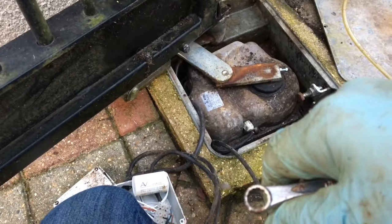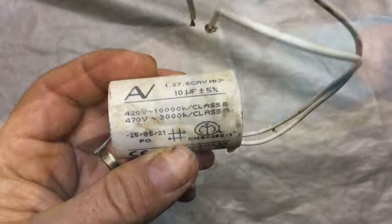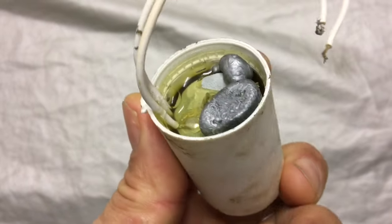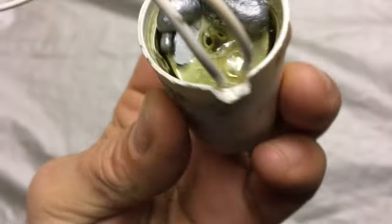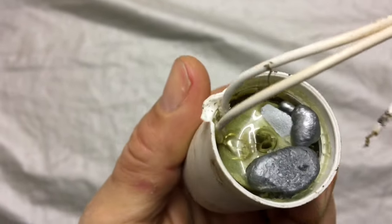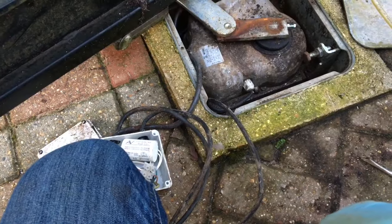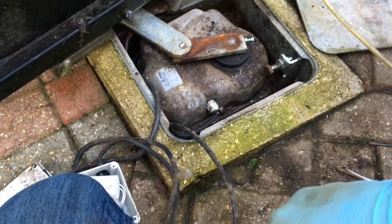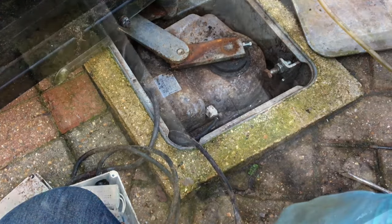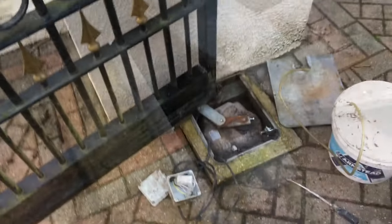The gates are now working, or will be once I get all these new parts. Have a look at the description — I'll put some links in for where to get these capacitors. Just out of interest, if you prise the end off this capacitor you can see inside how catastrophically it's failed — there's lots of horrible gunky metallic-looking substance that's oozed out of it, so obviously it's not very healthy. If you have the same problem, that's how to fix your NICE electric gate. The motor has a code of ME 3000 on it — looks up on the internet as a fairly common motor. Thanks for watching, bye.